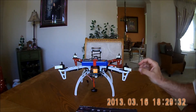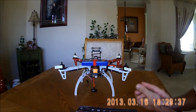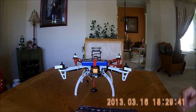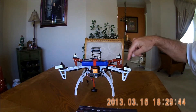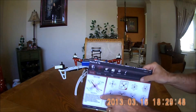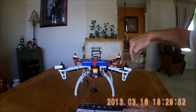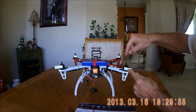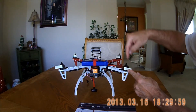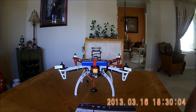And if they're not, it's just a matter of swapping out two of the wires. Any two wires will change the direction of the motor. All right, let's give it a shot here and I'll show you what I'm talking about. We're going to start at four here because it's the closest. So we look here — forward should be spinning in a clockwise direction, which would be this way. So if my finger was on this side, the post-it theoretically should stay on, and as I view it coming straight down, I would see the little tail of the post-it. Let's give it a shot.